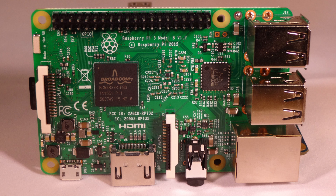On the top you have the 40-pin GPIO, which the Raspberry Pi is famous for. On the bottom you have your power in, your HDMI port, your camera connector, and your composite video and audio out. On the right side of the board you have four USB ports, and on the bottom you have a 100 megabit Ethernet port. To the left side of the USB ports you can see the SMSC chip, which is the USB controller that powers the Ethernet port as well as the four USB ports. On the far left side of the board you have your display connector, and right above it that little plastic piece is the Wi-Fi antenna.